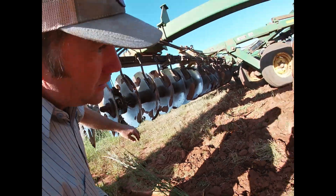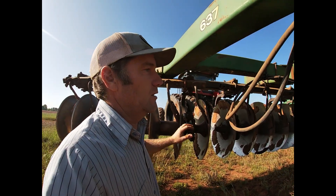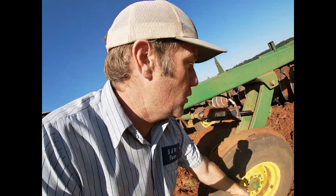Make sure nothing's going on with a disc harrow — things can work loose. If anything gets loose on the harrow it just eats everything up. You can't have any loose parts; gotta keep a check on all that. I'll check the wheel bearings also.